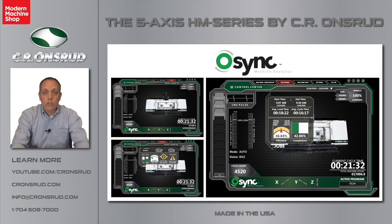O-Sync is machine analytics and monitoring software that we developed here at CR Onsrud. This software resides in the controller interface and constantly monitors the machine health and productivity, reporting all of that information back to you. On the productivity side, the software can monitor things like spindle up and downtime, part count, and keeps track of how long your machine has been in each mode. Clients with multiple CR Onsrud machines have O-Sync running on each one and can compare and contrast to see if there's maybe an issue with a machine, a setup, or an operator. On the machine health side, O-Sync constantly monitors the servo loads, system voltages and amperages, and keeps you up to date on any preventative maintenance information. You even have the ability to set email or text alerts based on your work schedule.